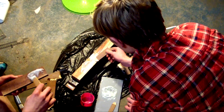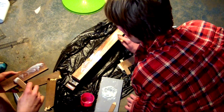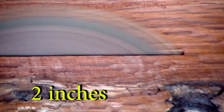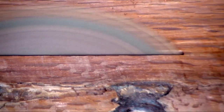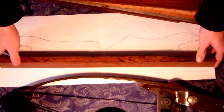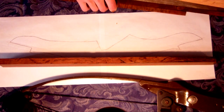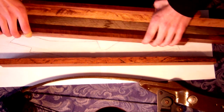Note this is for basic straight laminations as opposed to curved laminations. Cut the timber to width — I recommend around 50mm. Once this is done, I recommend placing the timber on your outline so you can get an idea of what it will look like and help you decide on the order of wood if you are using more than two types. Notice I have used different thicknesses in my timbers — I like this difference but it is down to personal preference.